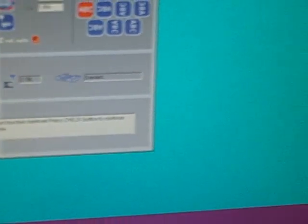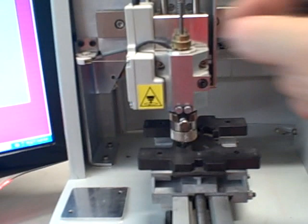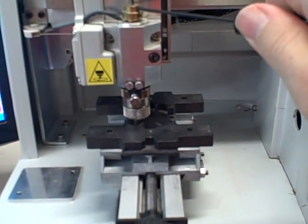It's going to go down and stay to the bottom. The next group of instructions is going to say to insert the cutter. We're going to drop the cutter right down to the center until it hits the bottom — so that's the bottom. Take our little wrench and we'll tighten up this little allen screw because now we know we're on the bottom. Just as snug — don't muscle it.